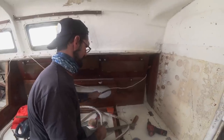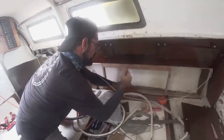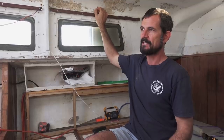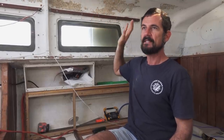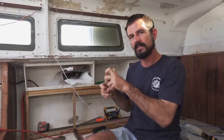By the middle of the first week, we've ripped everything out. Remember, this used to be cupboards and everything else like that. We've got back to the skeleton frame here. We've scraped a lot of the loose paint already off. Some people might think that's an unnecessary step, but it's a lot easier to clean up large paint flakes than paint dust. We still need to give all of this surface a good wash and a degrease before we sand — I don't want to use the machines to dig the grease further down into the sanding grooves.